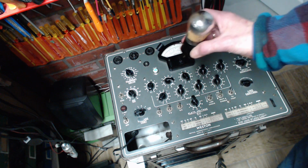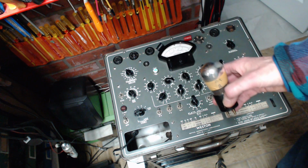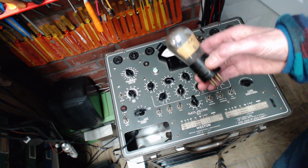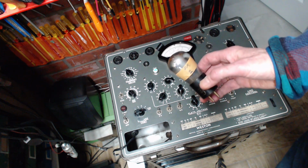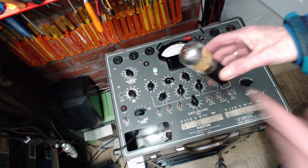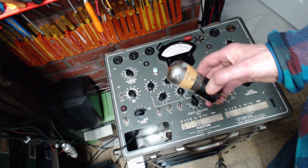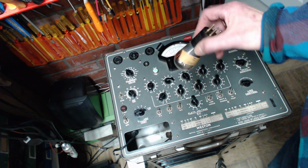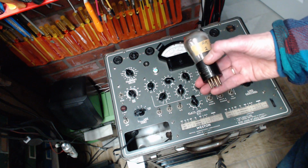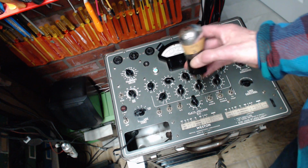When you first turn it on in a radio or a tube tester or something like that, the condition inside the tube could be poor. And over time, when the tube heats up, especially when the glass gets hot, the getter can be reactivated or becomes active. It can start getting all that stuff out of the vacuum in there. So I don't know the details of this issue. I don't know if it's even worth talking about. It's just something that's going on in these old tubes.